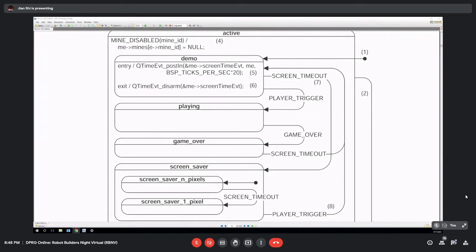If I could follow on to that, Carl, you may remember I said I wasn't going to describe the bumper and escape behaviors because I didn't want to get into it. But basically, that's a state machine or a set of state machines that go through a series. In subsumption, the term is ballistic. A ballistic behavior is one that keeps going even after the sensor has turned off. So each of those ballistic behaviors, for example, you might want to back up and then rotate, is a state. And you go from one state to the next based on timers or velocity or position or something like that.